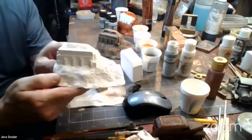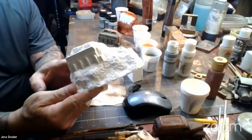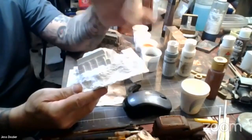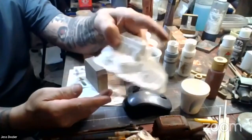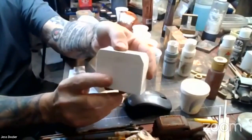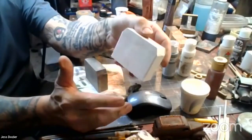These are just hydrocal castings that I made the patterns out of. What I literally started with — I basically just made a mold out of clay and timbers as a pattern. I roughed it up and got it to the contour I wanted. Then I just made an RTV mold, so I can make copies of these. Same thing on the other end is just a concrete abutment.